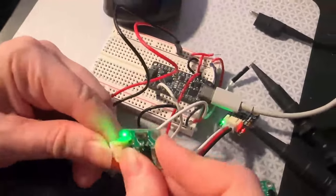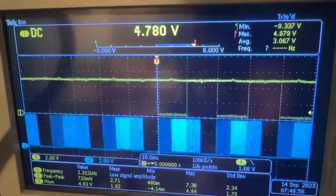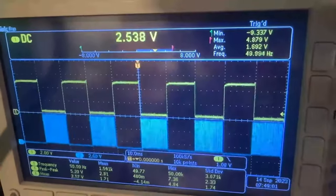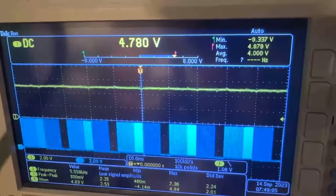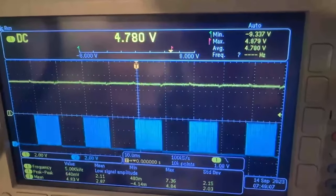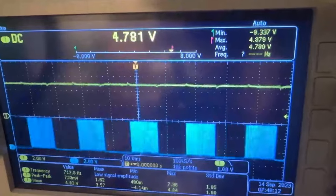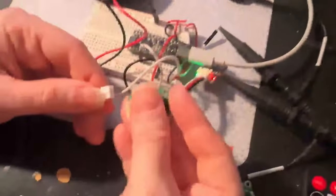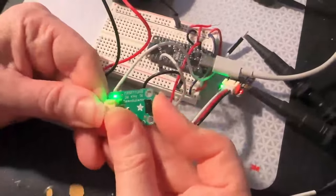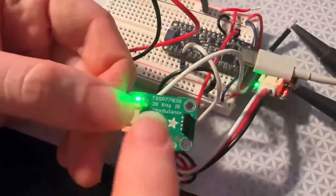When I plug the decoder in, it does detect the signal at first, but then the internal logic kicks in and says 'that's not a valid infrared signal' and turns off. So the decoder is good for infrared remote signals but not for just detecting 38kHz IR in general. For that you need a demodulator, which can be used for non-remote projects that still want to do infrared signaling.